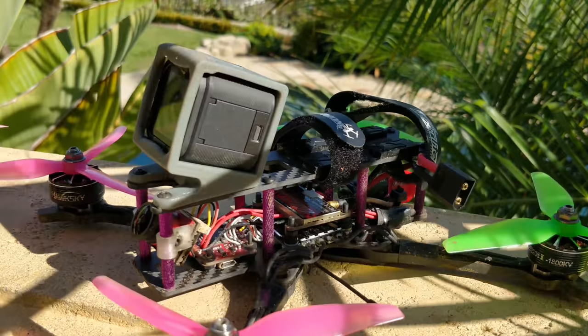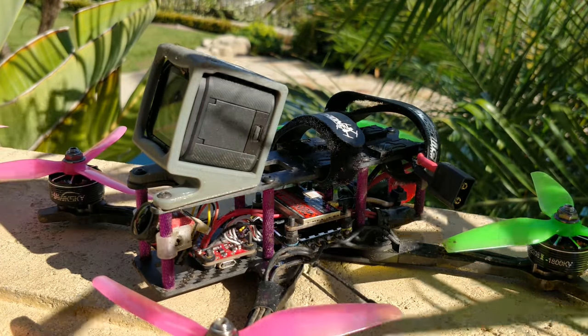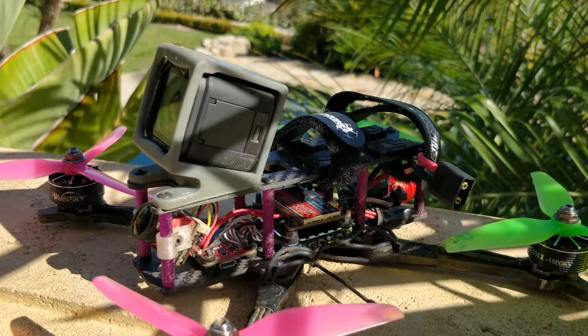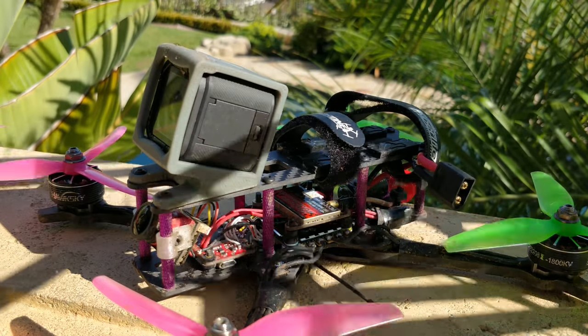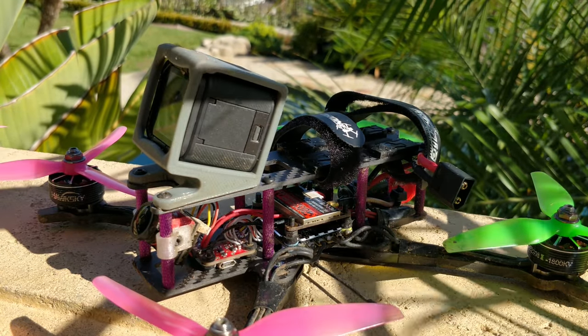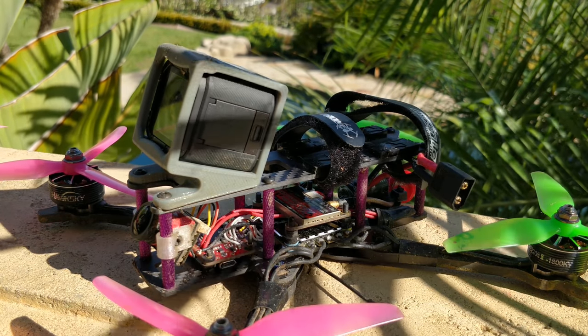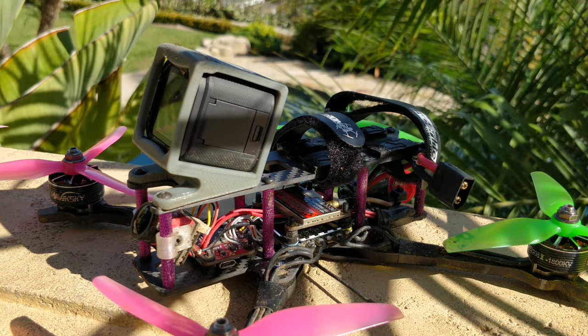The main reason I'm testing 35-millimeter standoffs is because many people don't like seeing props in view. It is a straight X frame, made 7 millimeters narrower front to back, but the props are still separated far enough to give that proper feel. With these tall standoffs you still see props in view. I've pulled the front out an extra 5 millimeters, tried to move the arms back, put 35-millimeter standoffs — and it still has props in view, specifically at low tilt, meaning 20 degrees and under.